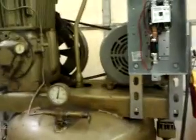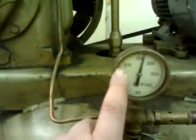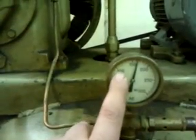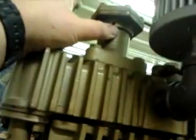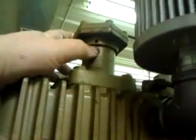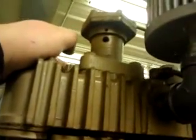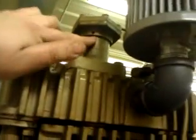And I've got an air leak someplace still, because right now, if I were to bleed this off to 150, by the time I come in the morning or 24 hours later, I'm down to about 120 or a little bit less. And it could be this bleed off, or the unloading tower here, because as I was told, I think it was Rotary Comtech who talked about in his rebuilding of his 325, that if you have a bad high pressure discharge valve, it'll actually leak here a little bit. And it isn't bad though.